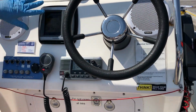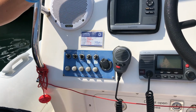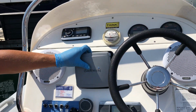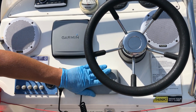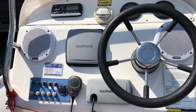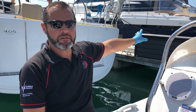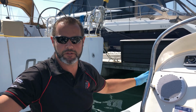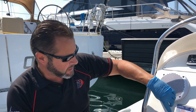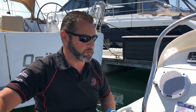And then the two instruments here, the easiest way is just the off and on here. Is just to turn everything off. Turn those off. And then when you get the boat done, please make sure these two covers are back on before you wash the boat down. So when you come back in, it's just a reversal of what we've just gone through. So the brown box over there, if you can get the soft brushes out, just give her a wash off with soapy water. The bilge pump should be set in auto all the time, so the water that you put inside the boat will naturally be dealt with.